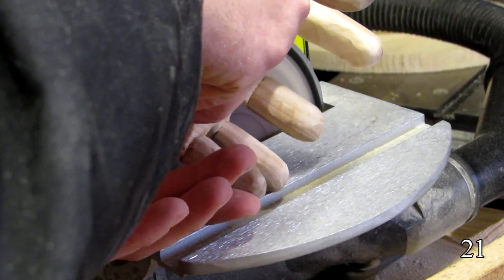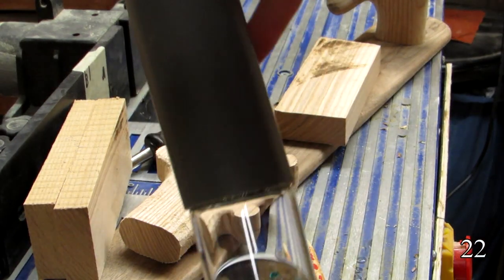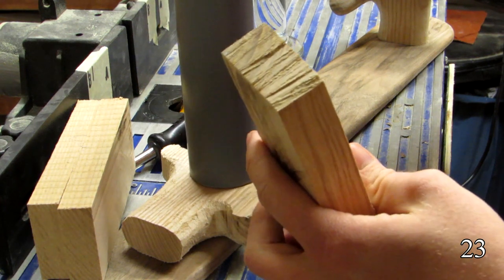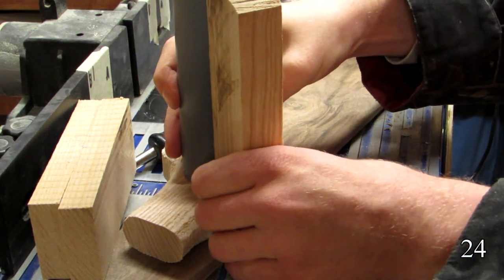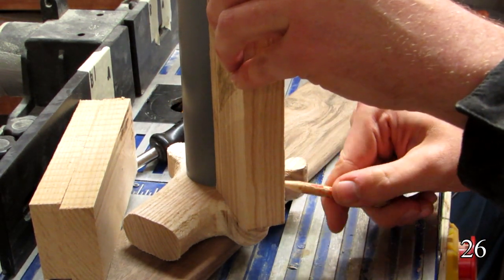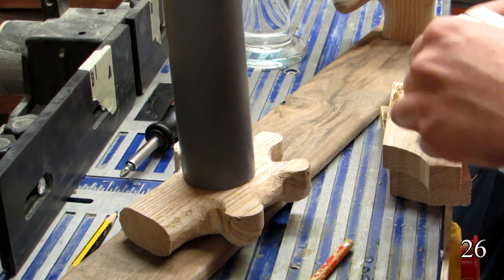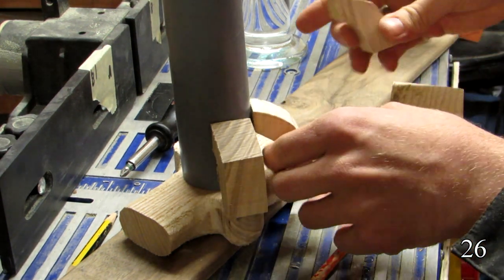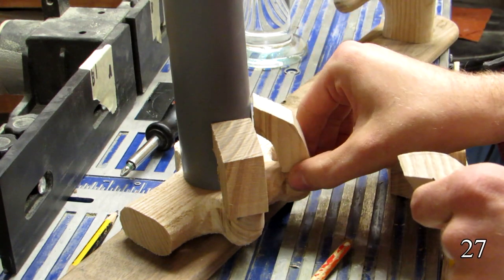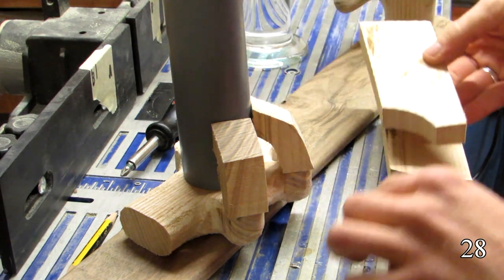The fingers need to be bent in order to hold the tube of the thermometer. To do that, I get my hands on a piece of plastic pipe that is almost the same diameter as the glass, and will not break if mishandled — it was a little larger, which gives me a little cushion for error. I place this tube on top of the upper hand, and this handy setup gives me a simple way to trace the base of the fingers onto the piece. I then outline what I perceive as a good shape and cut it out on the bandsaw. A word on grain flow: while it would really be cool to have the grain flow intact between palm and fingers, I only had the two pieces of ash on hand, so I decided offhand to just call it artistic license. Am I glad that this license comes without any fees.